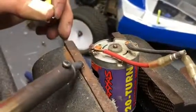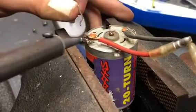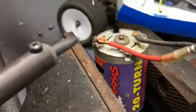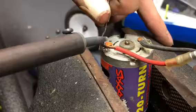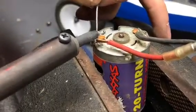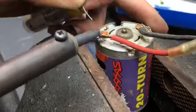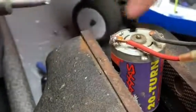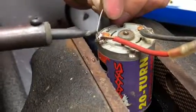It's a little difficult. Try to get that piece on there — drip it on the top, get it on the sides, just try and cover it with the solder. Easier said than done, but whatever works — use any method you can, whether it's getting it onto the tip, dripping it on, or just squishing it on. If it's frayed a little bit on the edge, that's good, because then the solder can get in between there and connect with it better.